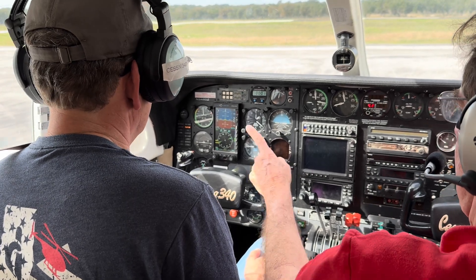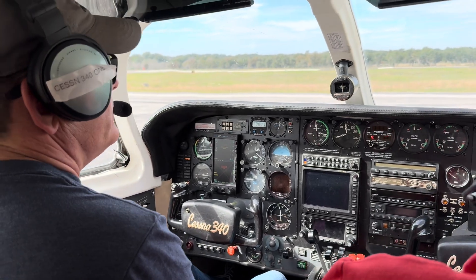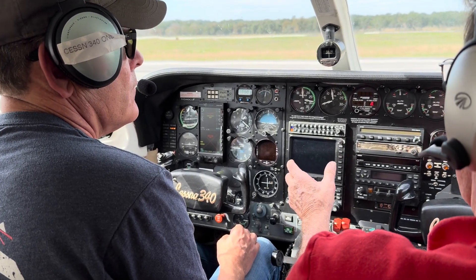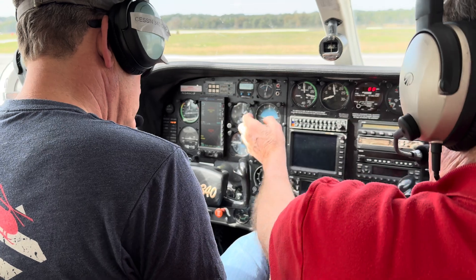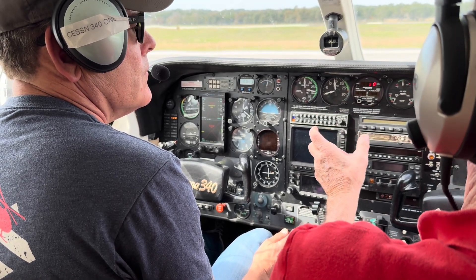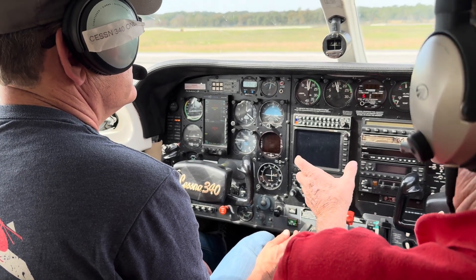Left — the dummy light is out. Let's put this on alternator. It will be working; we're just not pulling anything, that's why it's not doing anything. Now let's prime this — we're going to use the thumb for the start and the finger for the prime. Prime one, two, three, four, five. Pull it back and give it a little. You're probably not going to need any prime — it's going to start just like that. When you see it accelerate, get off of it.